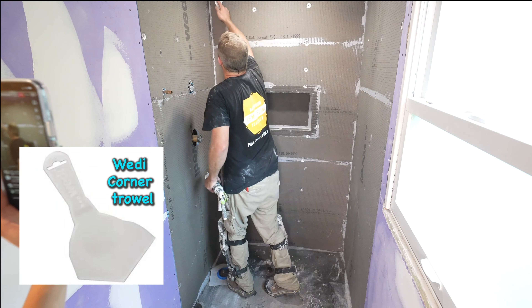We're going to put a valve trim on here. This is a valve seal — it has two edges on it, and one has a big rubber spacer on the back. That goes into the board and then you can thin set it. You can do it two ways — you can use the 620 sealant, which you can see is much more fluid. Then you just take an eighth-by-eighth-inch trowel and put this on there. You can also use thinset, which would definitely be the cheaper option.